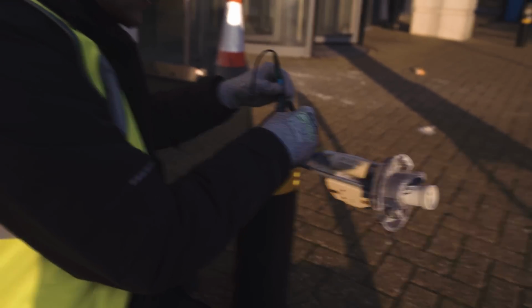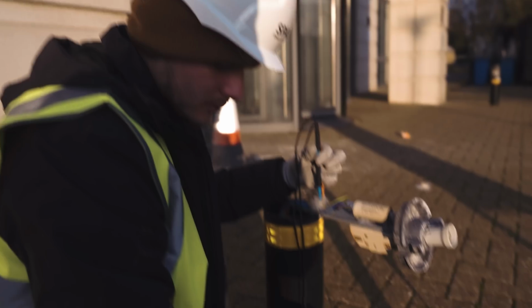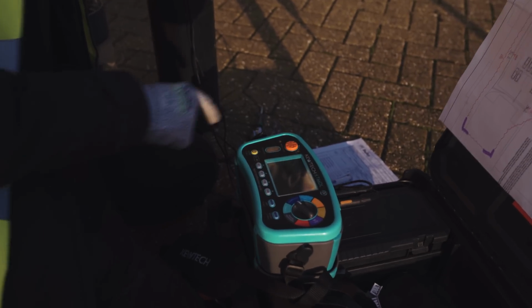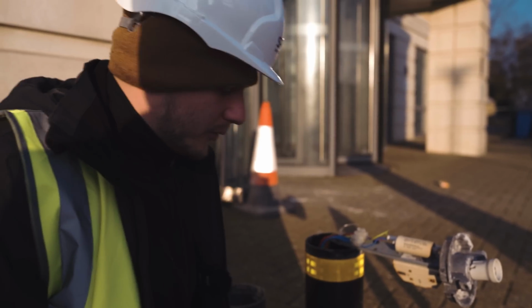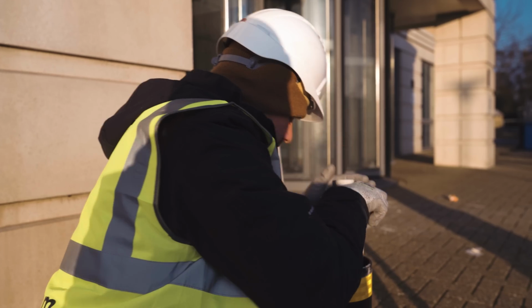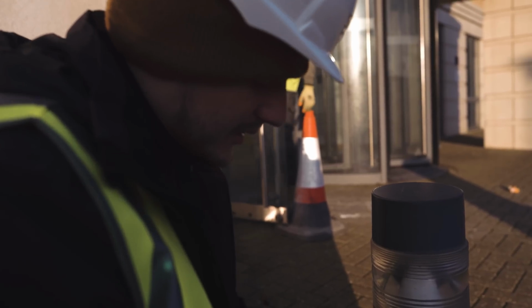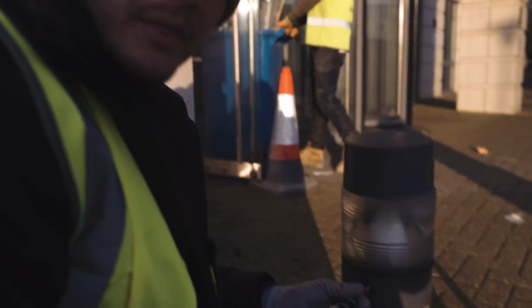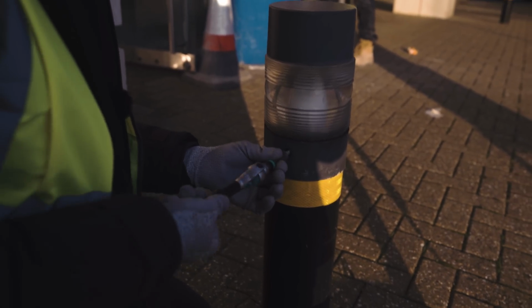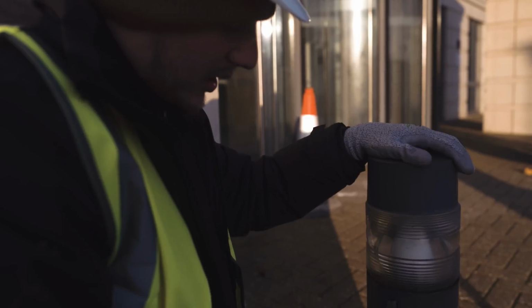I'm going to go between these two, and I've got 0.46. I was going to say that was way too high for the size of these 6mm. 0.46. These are made off atrociously. The steel wire armouring isn't even in. That's essentially an R1, R2 test. So live or R1 linked together with earth, or R2, at the board. And then obviously this wasn't end of line, but we just want to test at the end of line, and that'll give us our R1, R2.